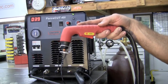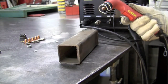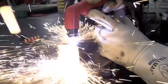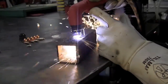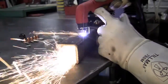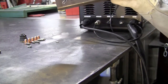Keep in mind your consumables will not last as long if you drag the tip. Here we have some 2x2 square tube with a 188 wall. I'll leave it up on 40 amps and 80 PSI and do a little cutting. And once again we went through that like hot butter.